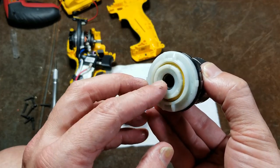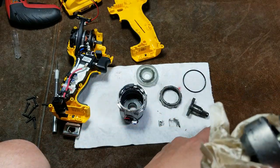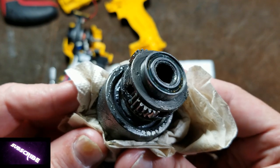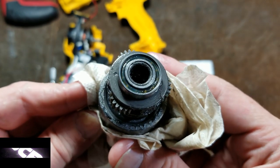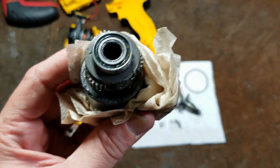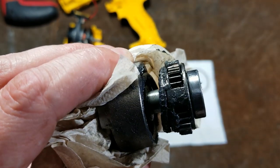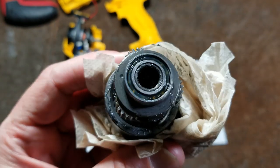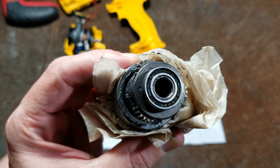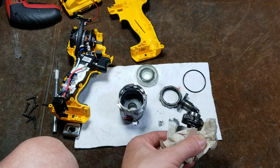The rear bearing is a tight fit in the back plastic — it's your bog-standard two-dog impact mechanism. A lot of manufacturers are now going to triple-gear systems versus twin-gear systems because gearboxes are what's wearing out most and generating the most warranty claims. They've finally upgraded to triple-gear gearboxes, which are 50% stronger. There's just an extra gear added, which reduces gear pressure for longer life, provides better centering with three points of contact instead of two, and generally a sweeter gear sound.